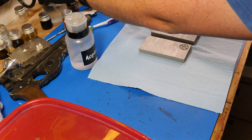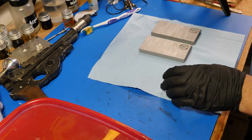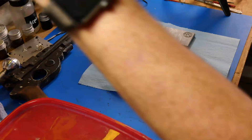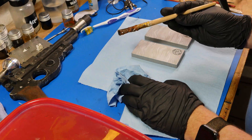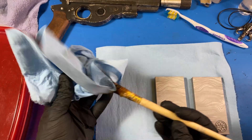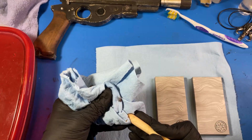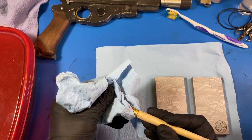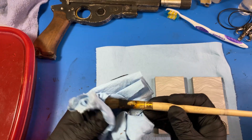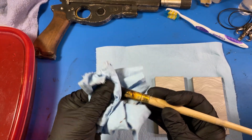When I did the gun, I found that you needed a good stiff brush in order to apply the compound. This is the brush that I used — it's been sitting in water and looks like it's been getting corroded. These antiquing and blackening compounds are basically just corroding the surface in a way that results in black.